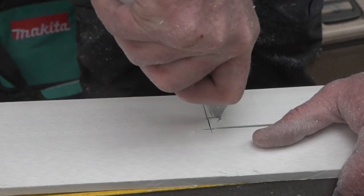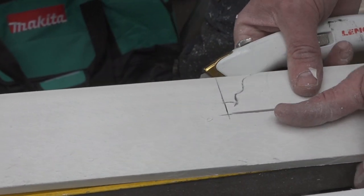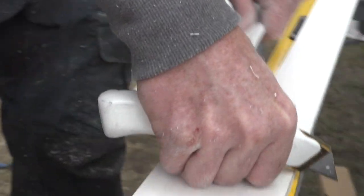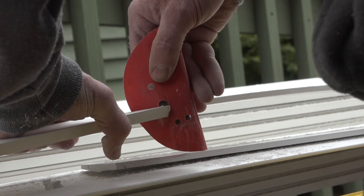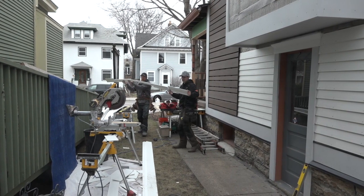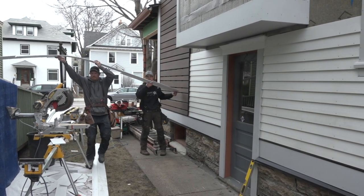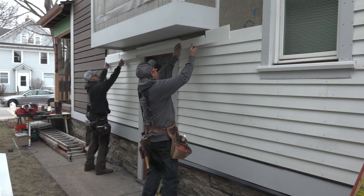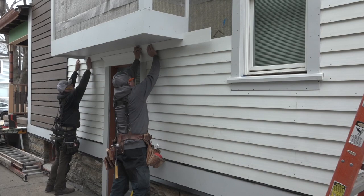It's not a bad idea to back bevel these cuts slightly to make sure that the face fits snugly. Similarly, he cuts the edges of those tricky profiles, and then he cleans up those edges with a bit of sandpaper. Now it's time for a test fit. To see how close this comes to perfection, they walk over and slip it into place. Again, the cost of breaking the workpiece at this point is orders of magnitude greater than the cost of it breaking earlier in the process.